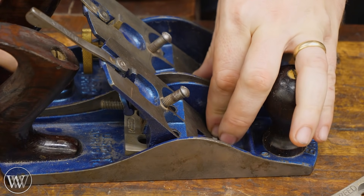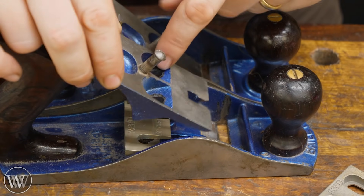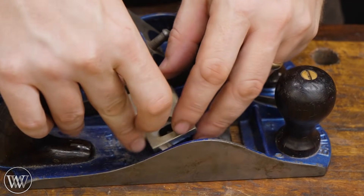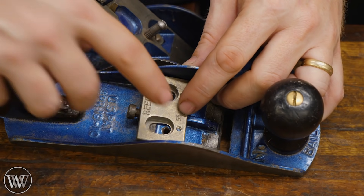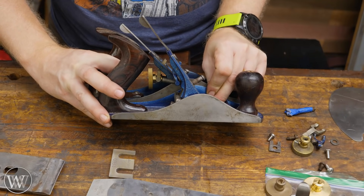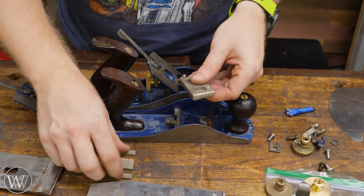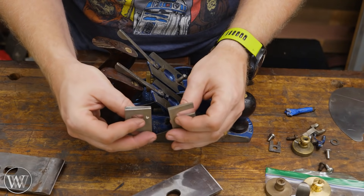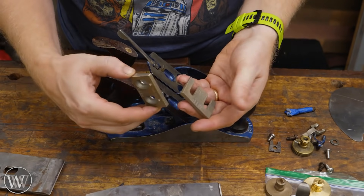That little bit can make a big difference when it comes to difficult grain. But sometimes you want it a little bit higher, and the problem is the screws aren't long enough to reach down into there. You could get longer screws, or you can do what Jeffrey has with the 55-degree: put it down into there, use your original screws to clamp it down onto the bed, and then you've got two new holes where you can attach your frog — giving you a 55-degree angle. You can see how that is a good bit higher, and it will give you far better finish on really difficult grain. These need a little bit of work on the screw sets. We'd like to know: would you want something like this with a 50-degree, 55-degree, or something in between?